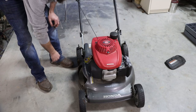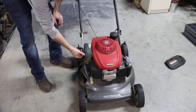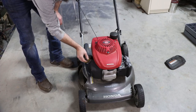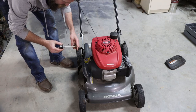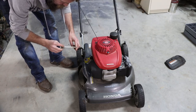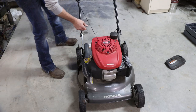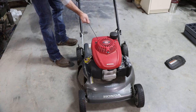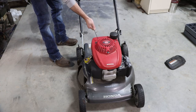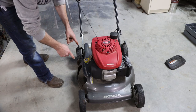So I guess, rather than check the crankshaft first, while you're on the side of the road, before you even take the thing home, unless you've got use for parts, pull the dipstick on it, check and make sure it's got oil in it. And this one does. And it's not filthy. So it hasn't been run out of oil, at least. That's a good indicator that it hasn't. And give it a pull, a light pull. That feels good. So now let's check the crankshaft.